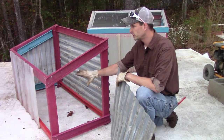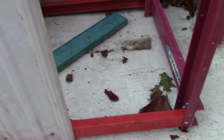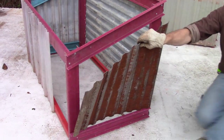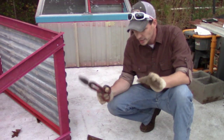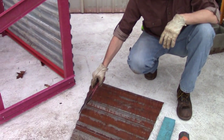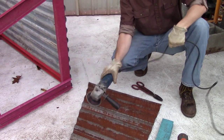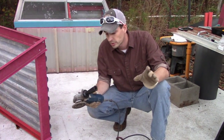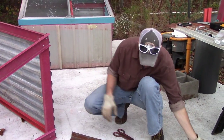Now that we have the main frame of the box put together, I have this corner left off so you can see the structure. We've got to put an end cap on this. I've cut out a piece of metal — I was using these tin snips, but they're an old set and don't cut metal well going lengthwise. To cut lengthwise on this metal I just used a four-inch angle grinder. Another nice thing about the angle grinder is you can clean up the edges, get rid of all the sharp corners, and make it so nobody gets cut when using the cold frame.